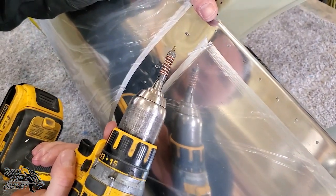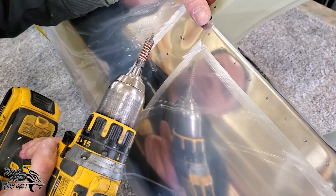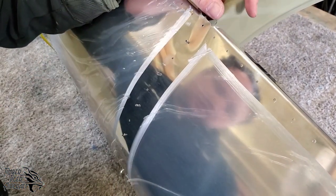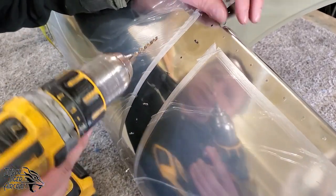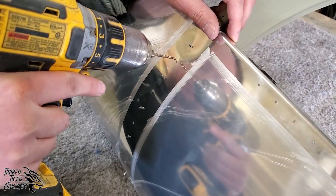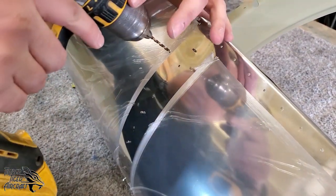We've got a drill stop on the drill. Some people prefer not to use them. And actually, in this case right here, I'm not going to use it because I know that I'll be happier that way personally. Now, make sure you know where the tip of that drill bit is at. If you don't, especially with a drill stop, you could put a hole there, not there. And with a new drill bit, it's very easy to misdrill.